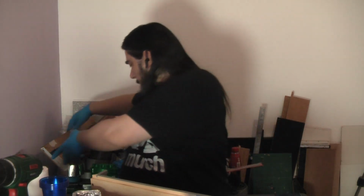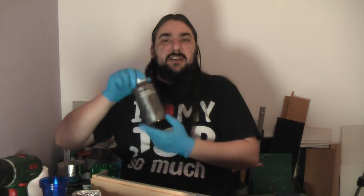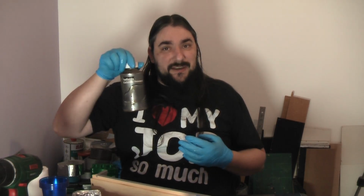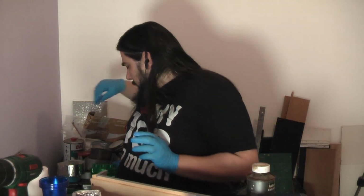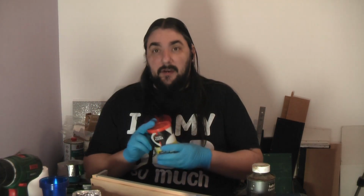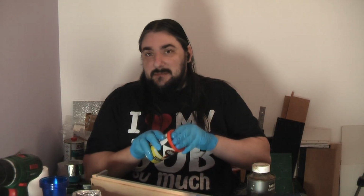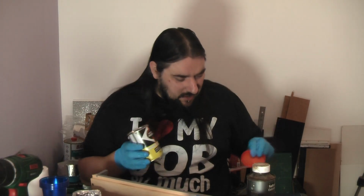The one thing I didn't show you guys, obviously I explained about all the resin and how to do it all, what about cleaning? Well, what you need are, and excuse this tin, it's older than me, cellulose thinners. It stinks to high heaven, but it will clean things off. Now, do yourself a favour, get an empty metal or glass tin jar, whatever. Don't use plastic, cellulose will just chew through it and then you've got a puddle of it on the floor the next day. So I always keep these metal coffee cans just for such a thing.